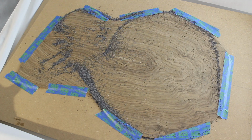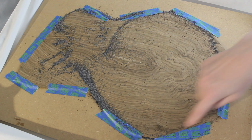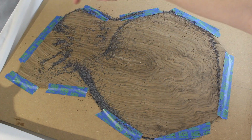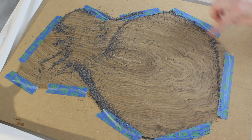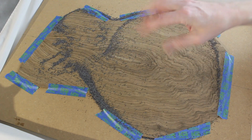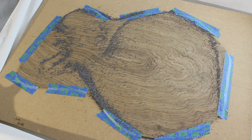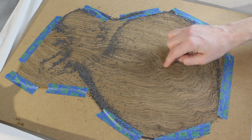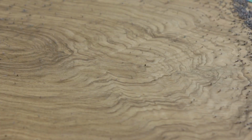Glad I kept that running. That's 88.6 Hertz, and that I would say is our true monopole. That's our classic drum skin. There's hardly any activity up here, although there is a slight vibration in this area. But that's our circular, that is our monopole, our true monopole. That's 88.6 Hertz. Quite what was going on leading up to that, I'm not sure, but that's our drum skin.